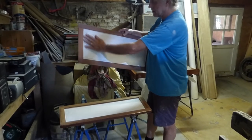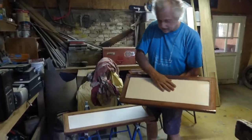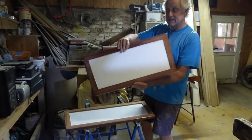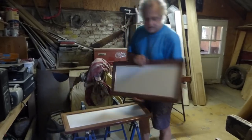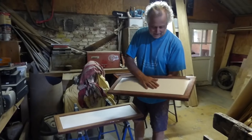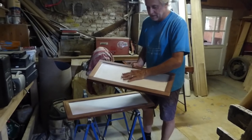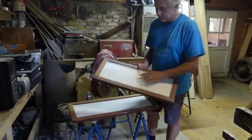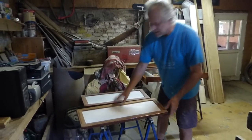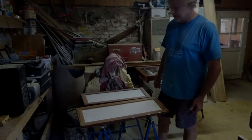So this side will be white, and I shall do this with epoxy primer and wipe. This side, undercoat here, will be the sort of off-white that the inside is. So that matches the outside, and that matches the inside. If you can imagine, it's a ridiculous lot of paint. That regular undercoat, and then the gloss varnish, obviously. This side, epoxy primer, and then the polyurethane two-part white paint. It's silly, they're not a big part, but it takes a long time to finish something like that. Finished but not finished.